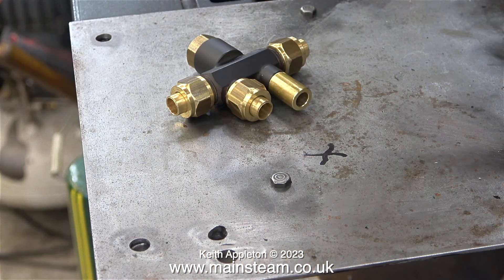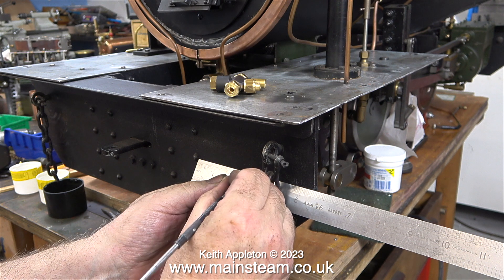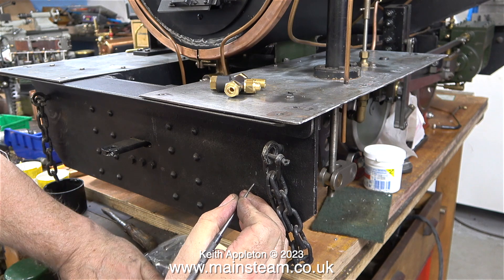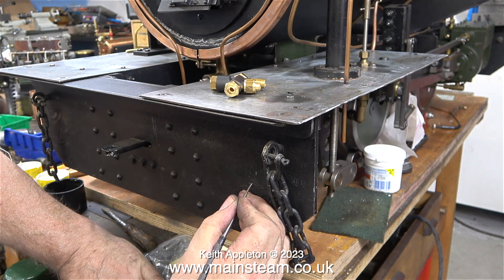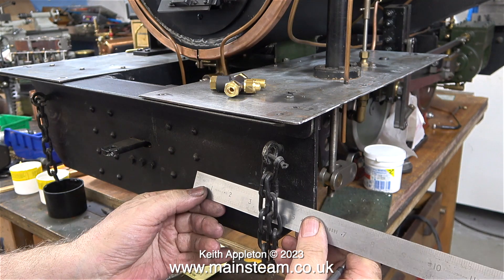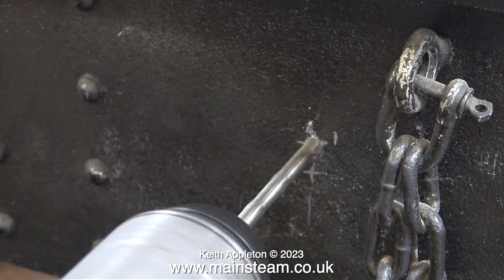The question is now how do I mount the injector to make it solid - I don't just want it to dangle on the pipes. Plus the injector is going to be fed with water from the tender of the engine. The best way to do it I think is to drill a hole through the buffer beam and make a special fitting to attach the flexible pipe to, and the other end will have a copper pipe which will support the injector.